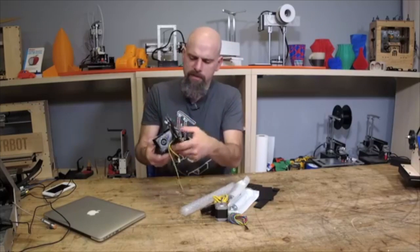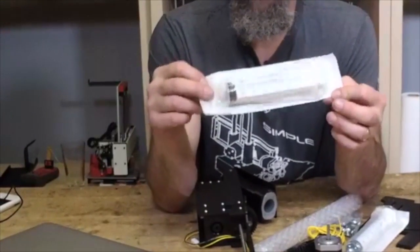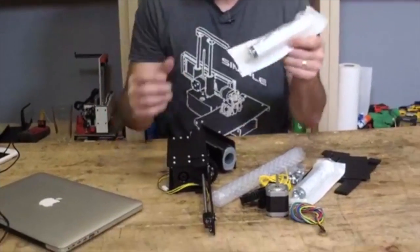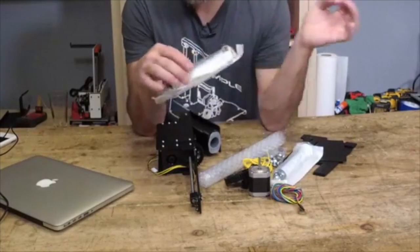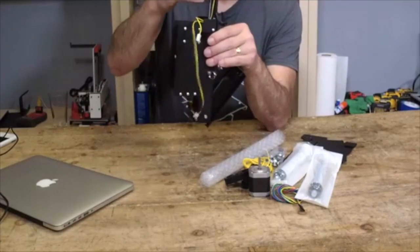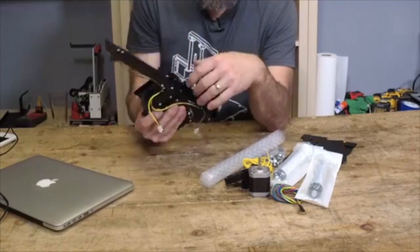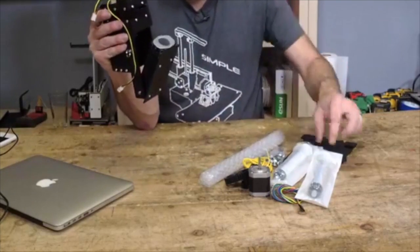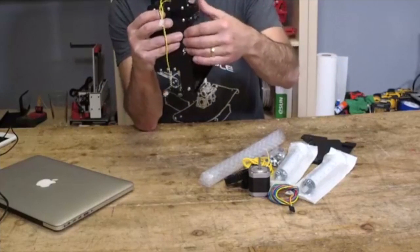What you do is you take — I send two of these, and I gave the link to Amazon for this. I got a whole bunch of empty syringes from Amazon in different sizes, and I decided this is probably the biggest one I'd want to design for. You pull out the stopper, take the rubber off the end, and you'll have a 3D printed part that goes on the end of this 1.25 Acme rod — old stuff, I use this on the old Simples. You pop that on there with a set screw, and then you'll have a lead screw compressing based on this instead of that long plastic piece, which isn't very strong.